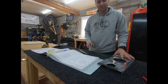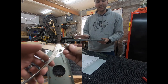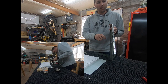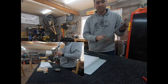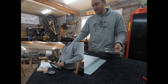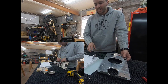Real quick — this part here is not primed on one side but is primed on the other. The reason is I scratched the surface, not sure if it was while using my air die grinder with the Scotch-Brite wheel or my deburring tool. Either way I buffed out the scratch and threw a coat of primer on it. Going forward, I'm not priming anything that still has its original protective coating from the manufacturer unless it's been scratched. If it's been scratched, I'm priming it. If not, I'm leaving it as is.